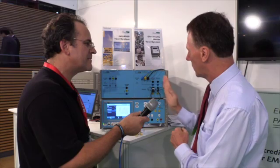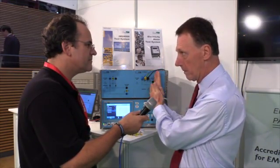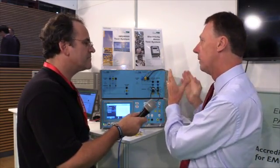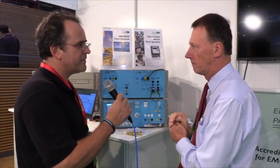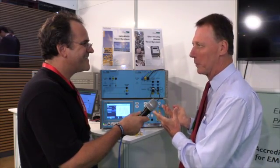The other cool thing is we have not only the capability to connect one energy meter — you can also connect a reference energy meter, so you can compare the results from a reference meter with the meter being tested. So when you're doing this, you're observing malfunctions or erroneous power measurements? Erroneous power measurements more than malfunction. And that's to the benefit of all of us because ultimately it's what appears on our bills.